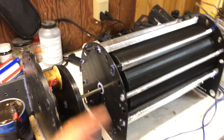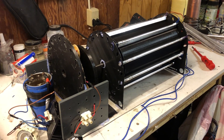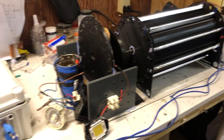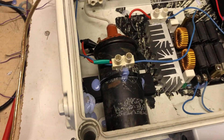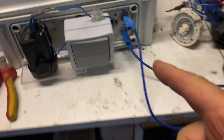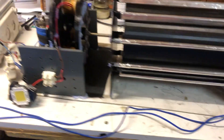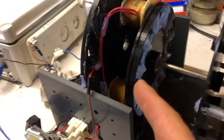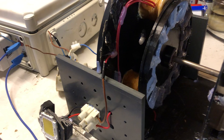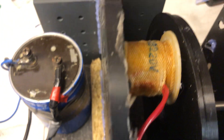I only have 10 at the minute but there's a major improvement on speed and efficiency. Same setup: 12 volt battery, ZVS ignition coil, Walton-Cockcroft multiplier, out to these two points here. I have five positive, five negative on the axle — a magnetic wheel, north-south north-south with neodymium magnets, and three coils.